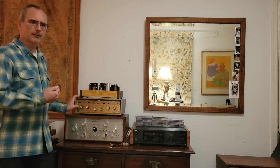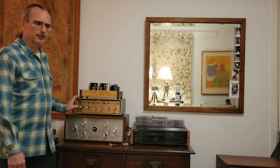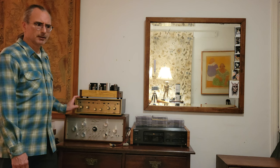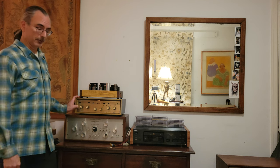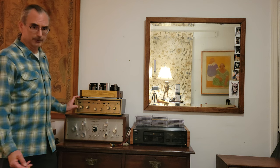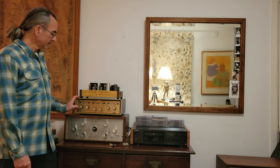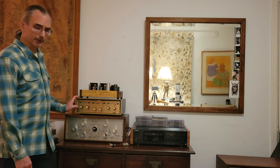Film caps for all of the oil ones previously, one NPO C0G ceramic, or a pair of those ceramics in the feedback network, all metal film resistors, and of course, electrolytic capacitors.